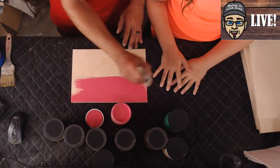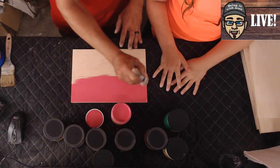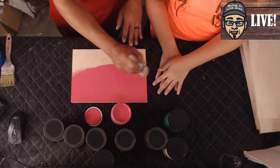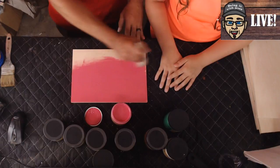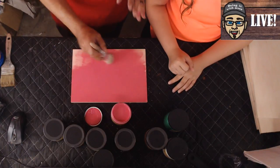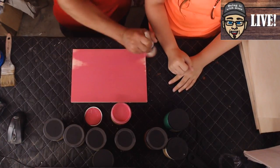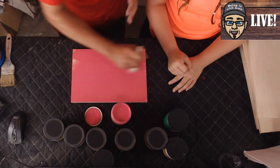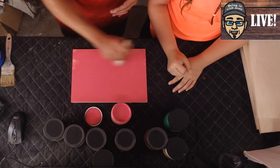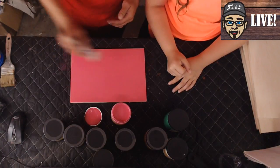Just go with the flow. While this one's drying we're going to do another color. We love the heat gun because it helps things dry a lot quicker, but you do not need one. When I'm painting a piece of furniture I do two coats — first coat, let it dry without sanding, then put on a second coat so you don't burn through when sanding. Keep your strokes really smooth; it doesn't matter if you see a little bit of brush strokes as long as they're all uniform.